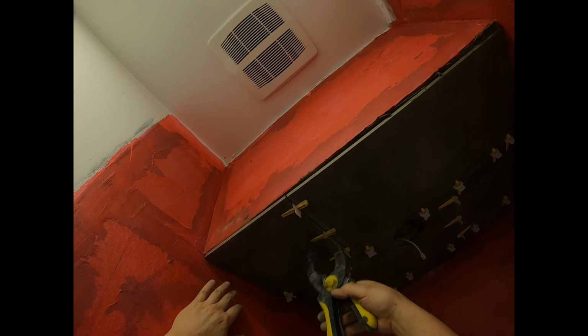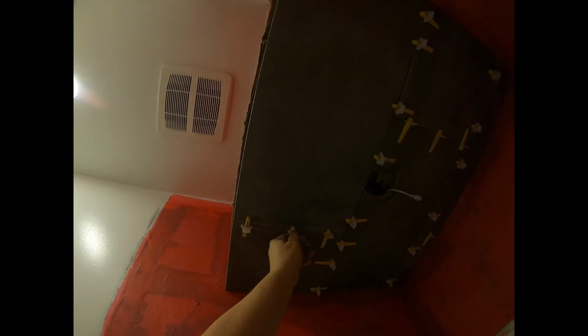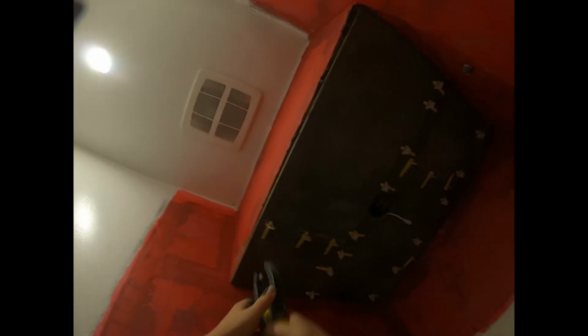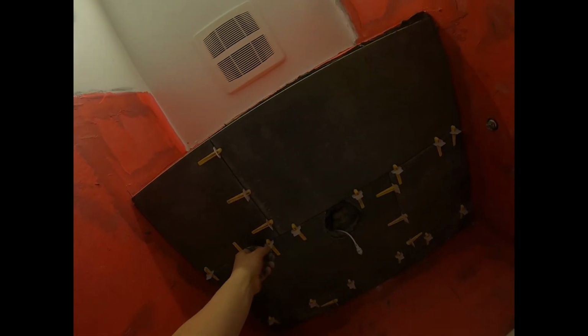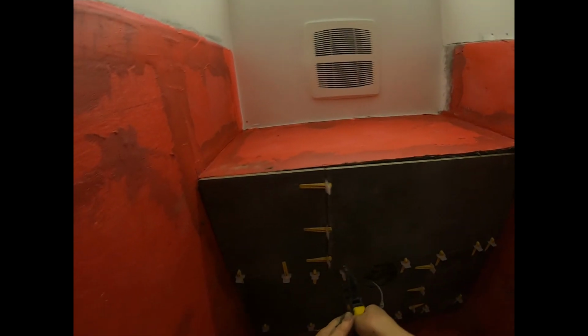And what will happen is the bottom of that T, the little T under the holder there, will snap off. So you get to reuse your wedges. And that bottom piece here, this little piece that sticks up, is discarded or recycled, and the other piece stays under the tile. Okay.